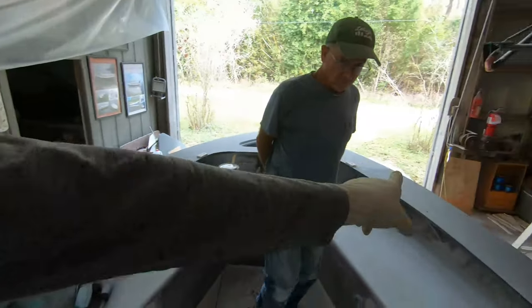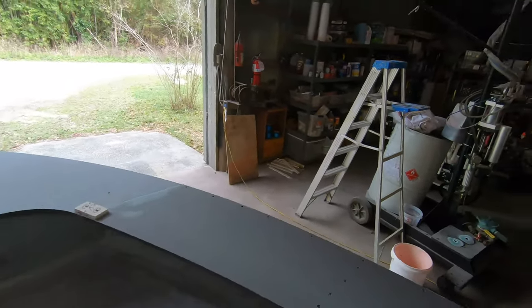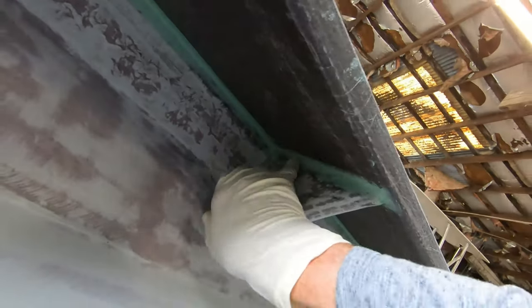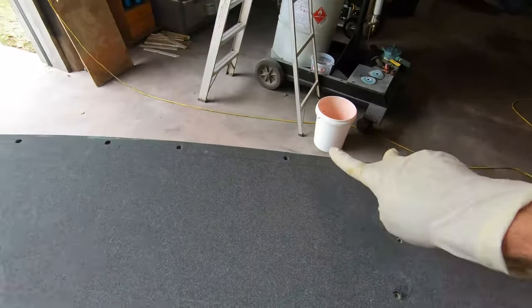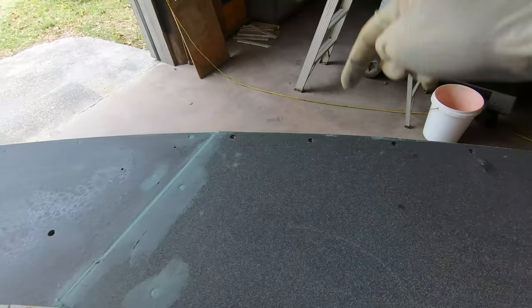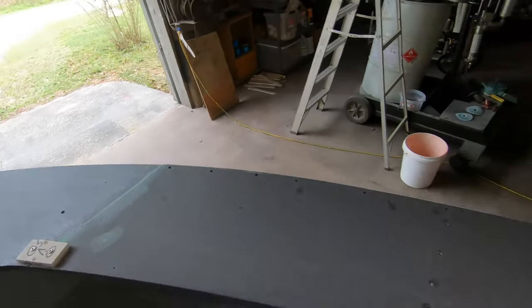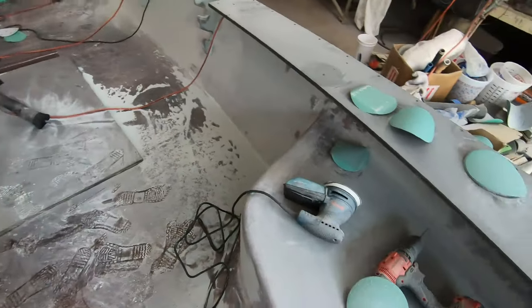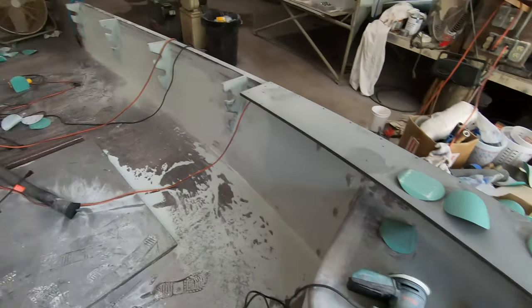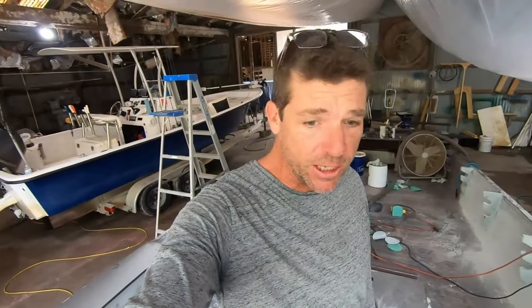But we also have this first section of gunnel that has been installed. You can see our brackets up underneath there, and we've used a high strength filler, and we've screwed down through this, about every 6 inches, through the Coosa. And then the seam here, and then we'll come back and fiberglass all of that. But we have been making a bunch of dust using an assortment of sanding tools. There's no one specific tool, but we are using a lot of electric stuff.